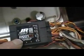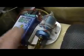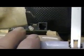There's the air tanks. Smoke pump is in there. It has a 12 channel 2.4 receiver. And there's the switch. There's where you fuel it up right there, and you hook the propane up right here. I got everything for the turbine right here, which makes it easy to work on. I got the ECU, the fuel pump, and the solenoids right inside there. And there's where you plug in the ground unit and the light that tells you when it started.